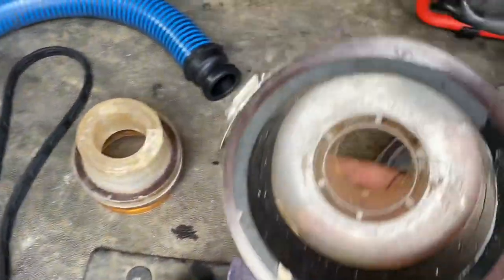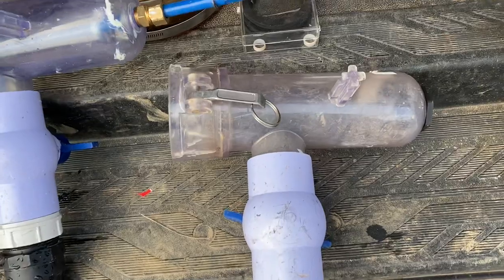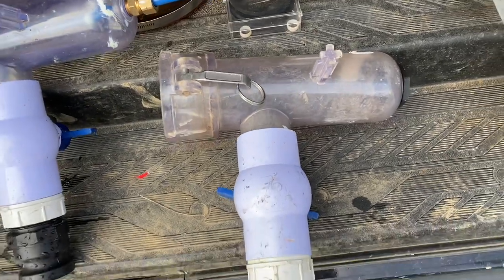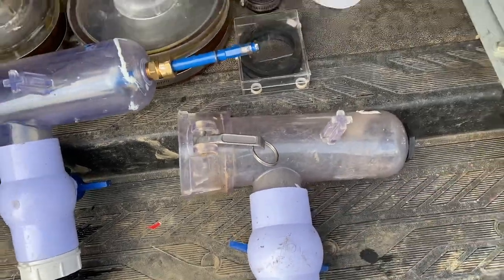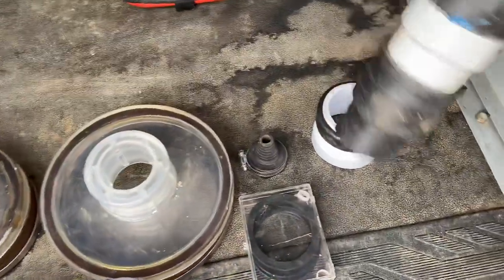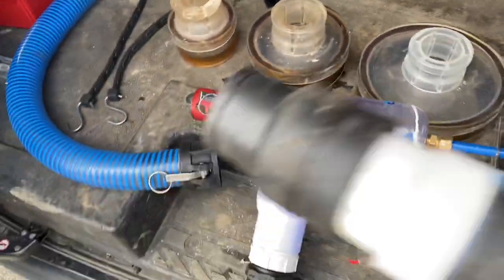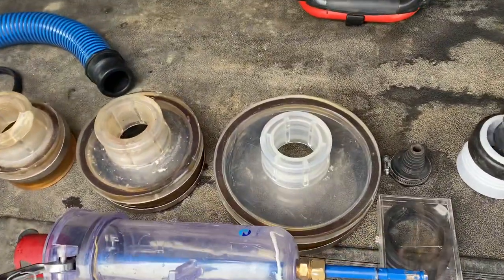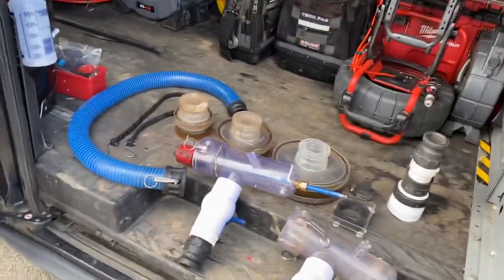When you're done, you can pump it back in — control all flow, no mess. Three, four, and six inch attachments are available. They have gaskets inside so you're able to fit different sizes, whether it's cast iron, PVC, or what have you. They also have a jetter attachment so you're able to jet from inside the building, again mess-free, controlling all flow through the shut-off. There are attachments for toilet flange connections as well.